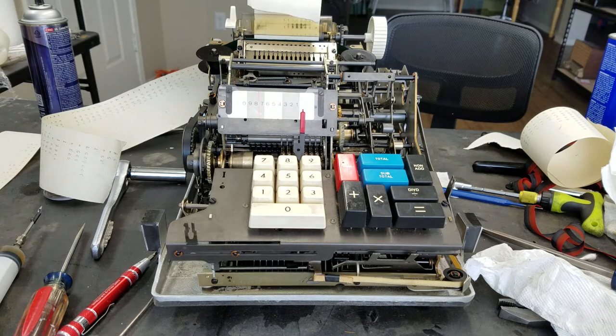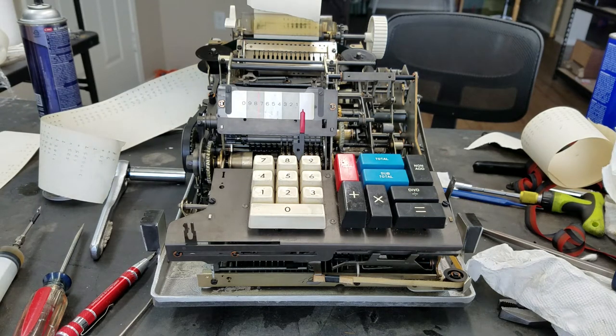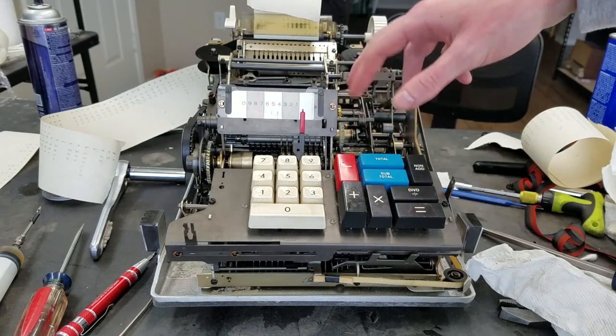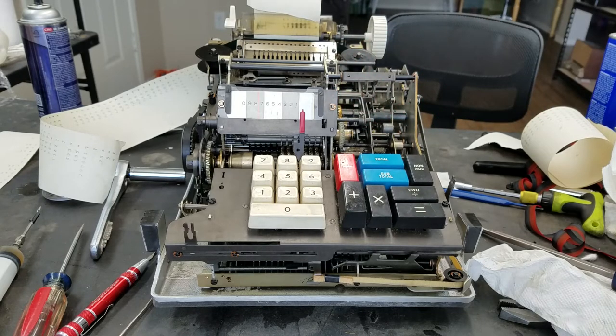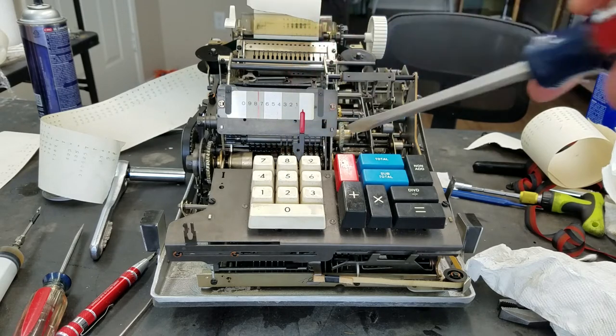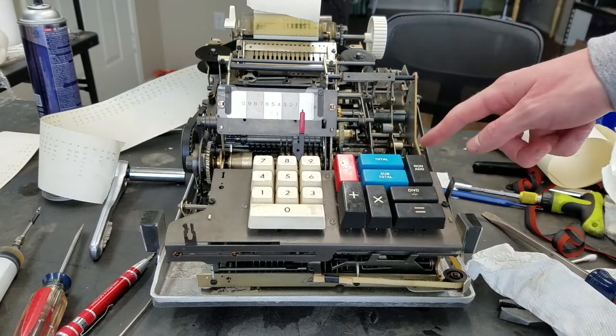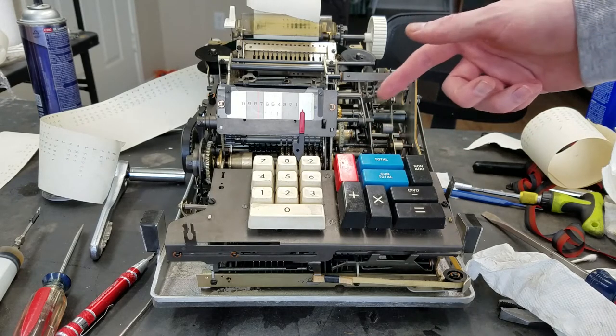Almost like it was adding instead of subtracting or something, and so I've been spending the last few days, not all day, but a couple hours here and there after work, trying to figure out what was going on with this. And of course, as we know, division is handled by the pinwheel part in the front, and I've concluded that the register for the pinwheel piece is all the way down in there. These gears, I don't think, are the gears for it. I think they're just intermediate gears that drive it. I'm not exactly sure of that because I can't see in there. But I think you can't actually physically see any part of the register except when it slides out the side here, because the whole register slides, obviously for entering into different positions in the register.